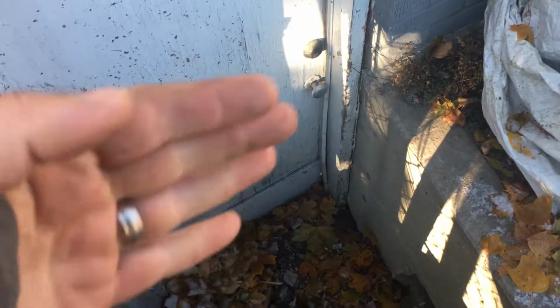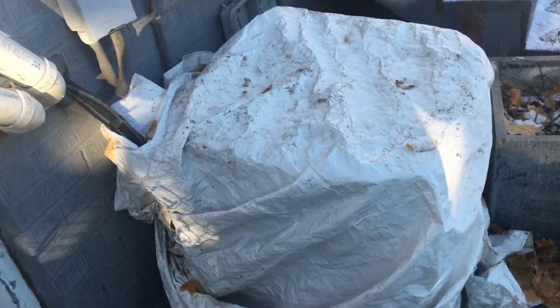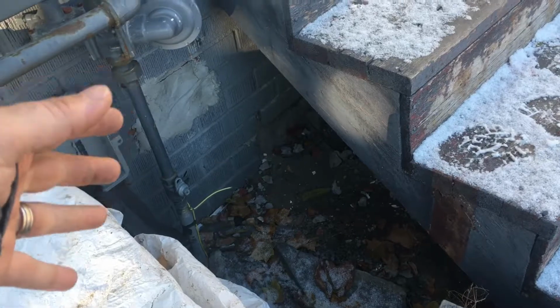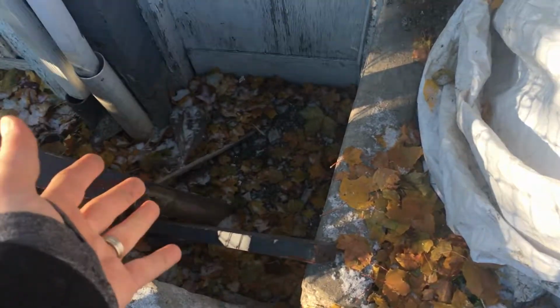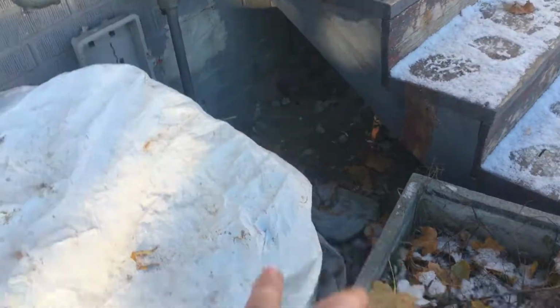Originally, I'm just going to move the garbage here. Originally I was thinking after waterproofing it, putting some dimple board around here and going inside the house with a trench, putting it over to a sump pump and having it eject out the front here. Something occurred to me that if we spill it out here, you're going to have fresh sump water pouring over here, running back down and basically percolating back into the ground that we're going to backfill. And essentially it's just going to keep recycling, going in, seeping down, getting pumped out and all that.